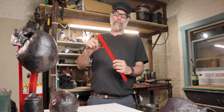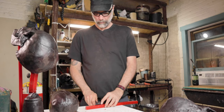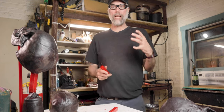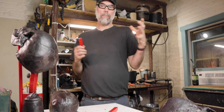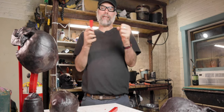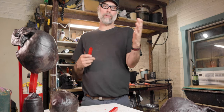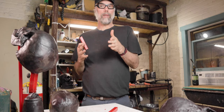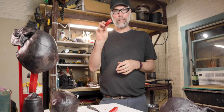We're going to shoot for about a four to four-and-a-half inch chunk of gate, and I'm going to use the three-quarter inch in this situation. In standard investment or sand casting, gates have to be considerably larger because you're pouring metal into a cold material that's taking heat from the metal. With ceramic shell, the shell is actually going to be hot — around 800 degrees in this situation — so it takes very little heat from the metal, which means I can get away with a smaller gate.